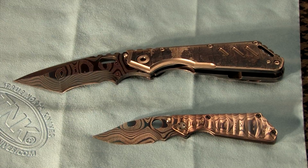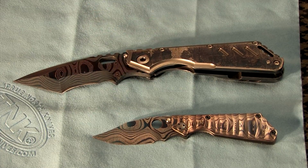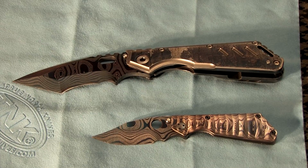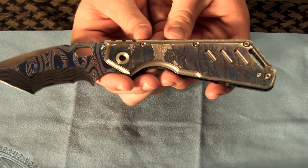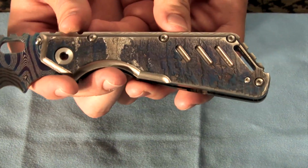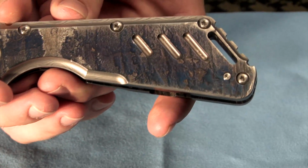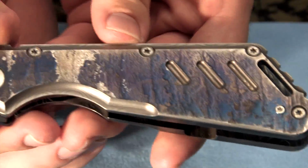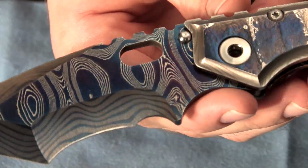handmade by Mick Strider. What makes these amazing is that every facet of this knife was hand-built, handmade by these Striders themselves. And so the Damascus, which is a fantastic color, was handmade by Mick and Marissa. The way they create their Damascus is by making a combination of materials in a layer. And so what they do is they'll take a piece of 1095, place it on top of a piece of nickel and then cobalt, and they'll stack up these layers so that there's 700 different layers.